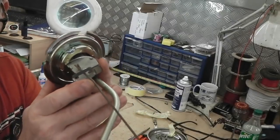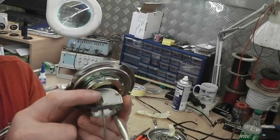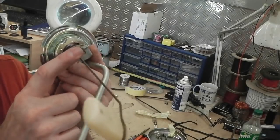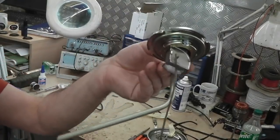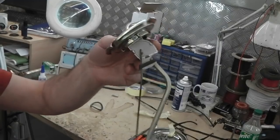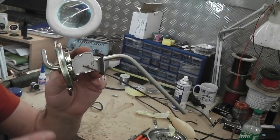I don't know if it is, I may be wrong. I'm not saying it is shaped differently, but if it was, then you'd alter the resistance on the last little bit of the gauge, so it would calibrate and still be level. I think that's the principle of operation. But as I said, this could be totally linear, and the tank could be parallel all the way down to the end. But we need to just check that the gauge is all right, because we've got a chance before we reassemble the pods and stuff to get the gauge.